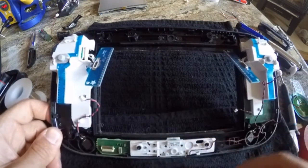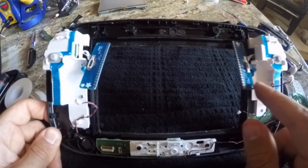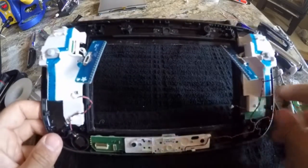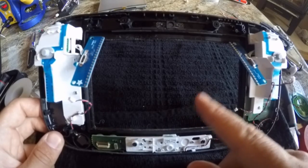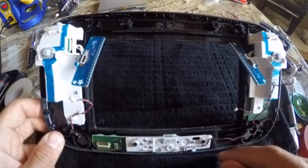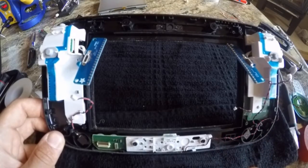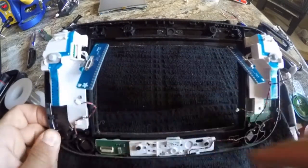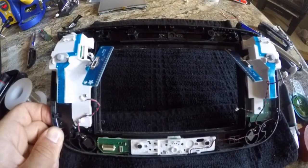Well here you guys go. It took me about an hour — I disassembled everything and made these boards and got the connectors all soldered on both sides. I actually made four of these, so I will be building two of these. One is going to have a 5 inch screen, and I'm going to decide whether to run a Pi Zero in that one or go with a Raspberry Pi 3. I'll also be making one with a 6.2 inch screen — that one won't have a battery pack, it will just have power input, and that will have a Raspberry Pi in it for sure. Now all I have to do is come in here and hook all these buttons up to my Teensy, wire that all up, program it, and I'll be good to go.